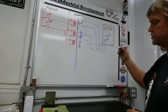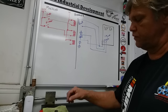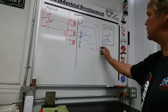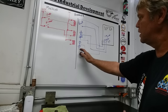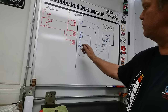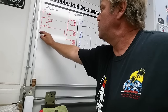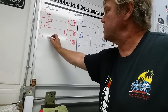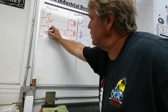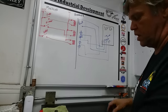These are just examples and it's only limited by your imagination in how you program and wire it. We've got another set of switchgear open — let's give it a reverse run command, terminal R3. Again off the common, we jump over to the common side and come back to R3. When the coil energizes, that contact closes and we get a reverse run command. It could be a forward/reverse switch: when the switch closes and the coil is powered, the contact closes and gives us a reverse run command — pretty simple.